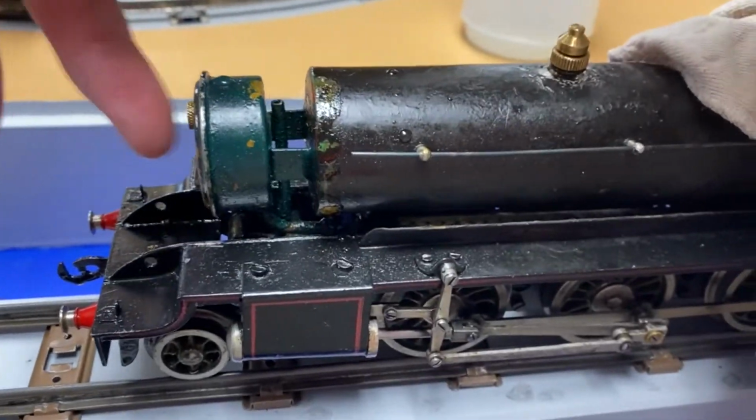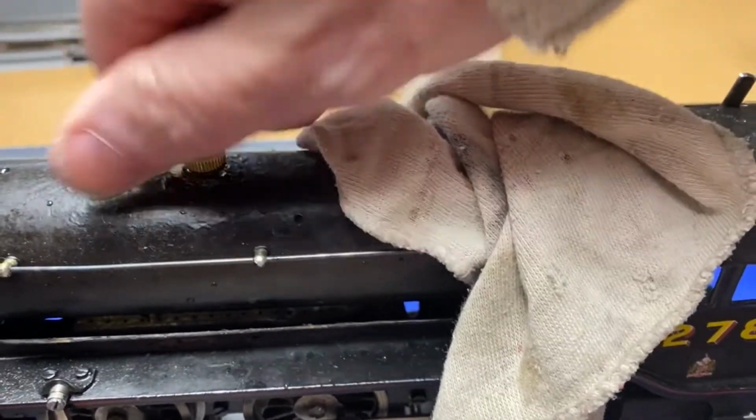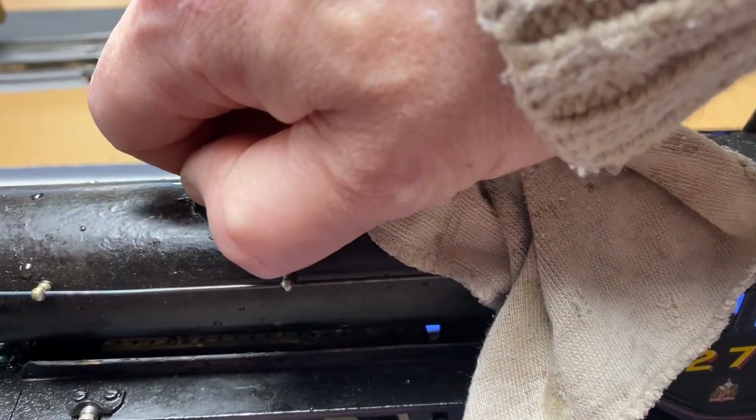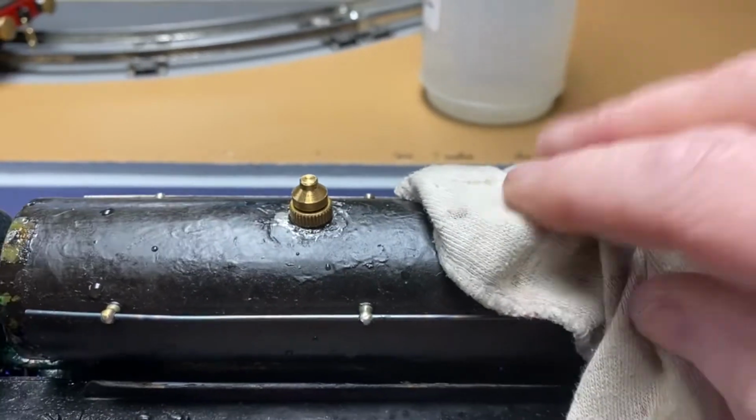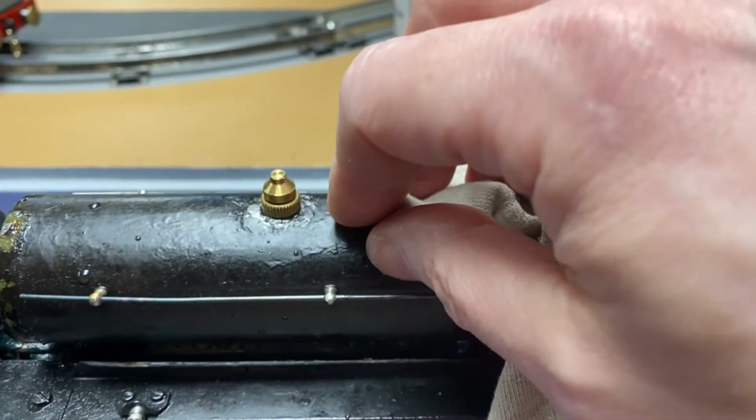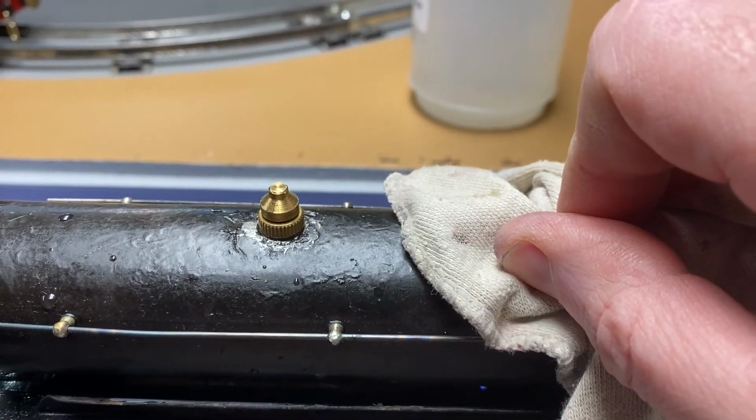When screwing these various plugs back in, you only need to do it finger tight, just finger tight. Let the seal do the work. Don't wrench on it, you'll have a hard time later, especially when the metal is heated up and everything's cinched together nice and tight. Also, you don't want to wreck your seal.